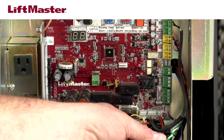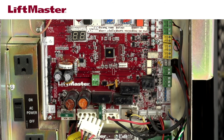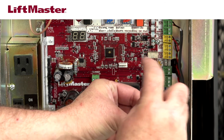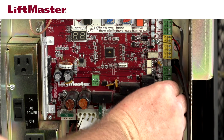We're going to connect to the accessory power on terminal. Remove the terminal block from the board. Insert the white wire into one hole and the green wire into the other hole on the connector — polarity is not important. Secure the wires in the connector using a small screwdriver. Plug the terminal block back onto the board. Note: use of the heater is not recommended for solar applications.